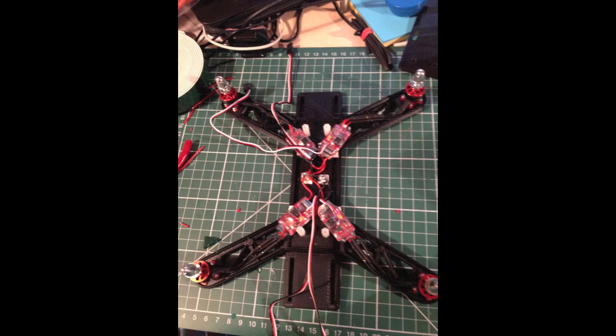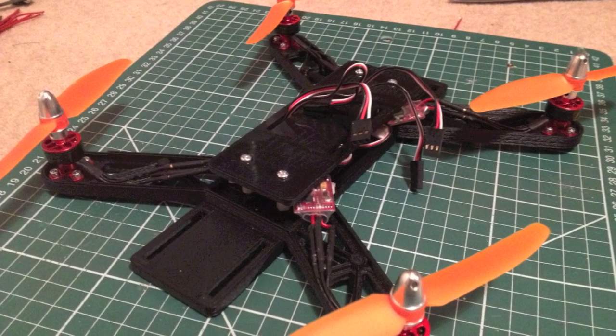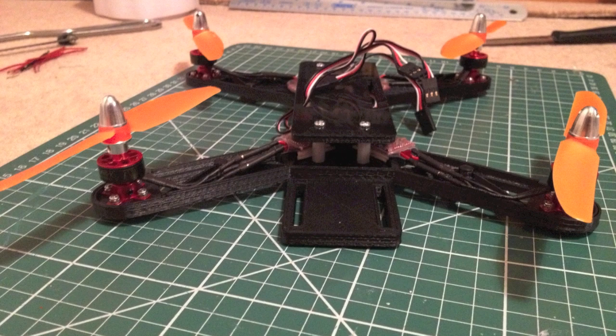Here's all four of them. After messing around a bit and seeing if I'd get the ESCs nicely squished in under the two plates and trying it on the arms, I've gone with a kind of half-in, half-out approach, which gets them tidied away without really trying to squash them in there. I guess they'll get a little easier cooling that way. I ordered some smaller risers, so I'm on these 15mm ones. With all the ESCs wired in and hooked up, it really does give quite a nice low profile, so I'm pretty happy with that so far.